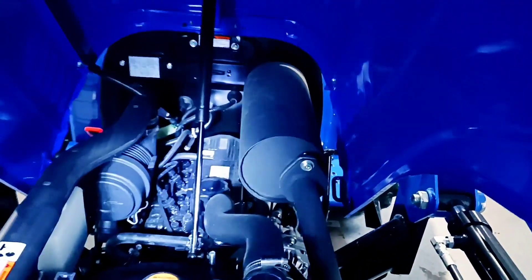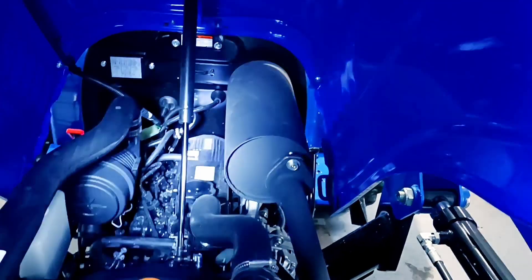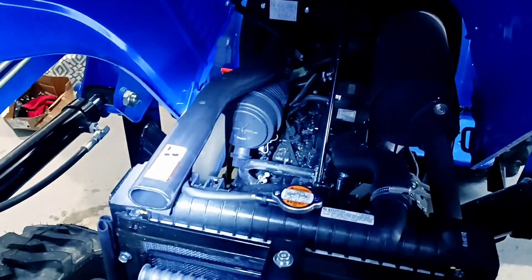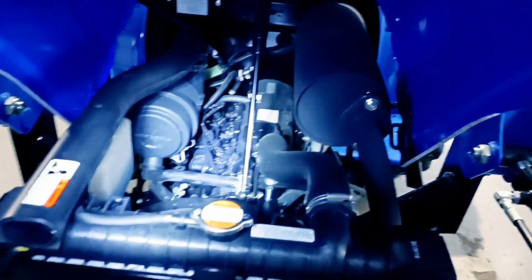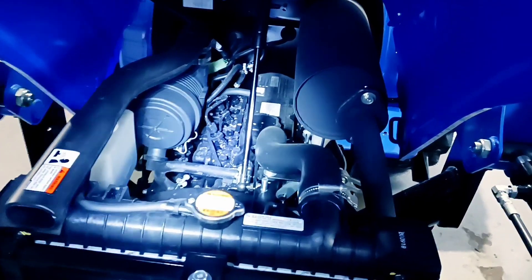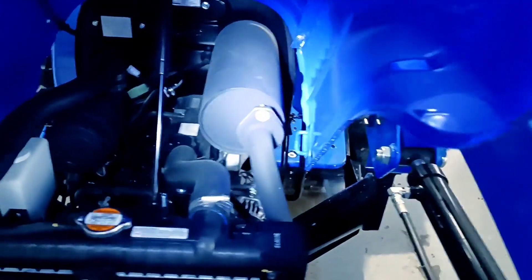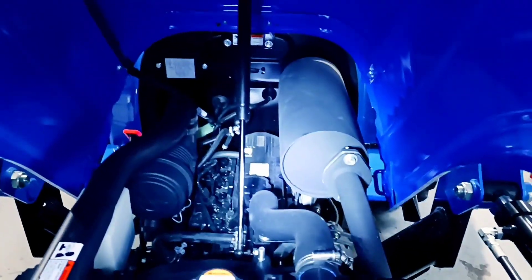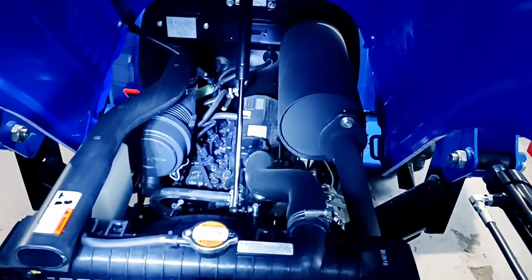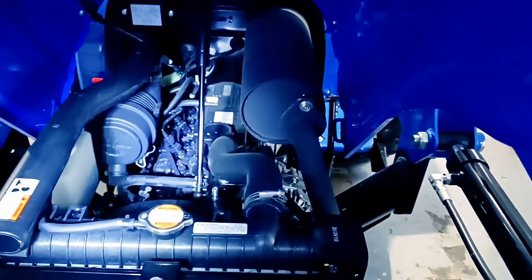This is a good example. Obviously this is a 25 horse engine, so it doesn't have to meet those standards. You've got a very traditional setup here like you've seen for 100 years - that's your air filter over there, a very simple air intake tube going into the air filter, your injectors down there, just a very plain, simple mechanical style of injection. You've got a standard muffler, just like you've seen for 100 years, nothing fancy about it. The muffler exhausts out the pipe right there. It's really simple, really reliable, easy to diagnose if you have an issue - nothing out of the ordinary.